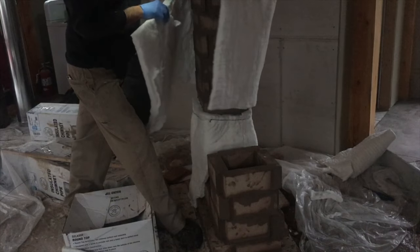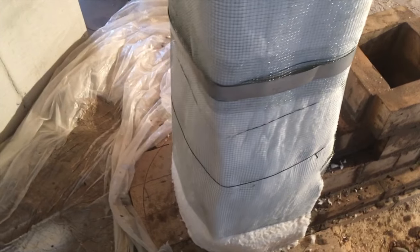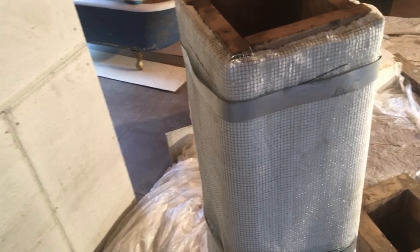there, which means I had to go back and insulate the heat riser. We used what's called DuraBlanket. So you cover the DuraBlanket with 1/4-inch hardware cloth, and that's just because it's sort of a fragile material. And if you take the barrel off to clean in there, you stick a vacuum tube in there, you just don't want to tear it apart. So you cover it up to protect it.